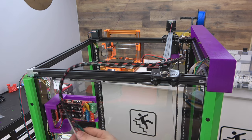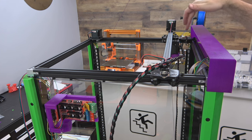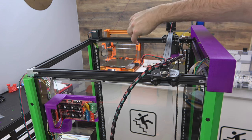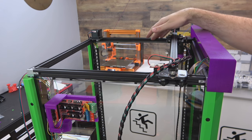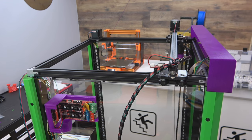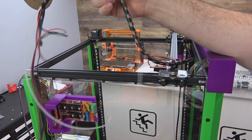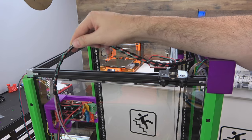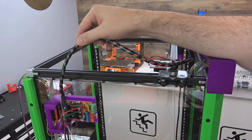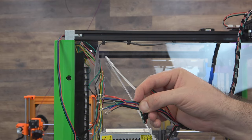I've got all the wire wrapped back to the control box. I did just realize the control box is flipped upside down, so I'll have to change that. I made a few changes as far as how the wires run — the Y end stop being the biggest one. I had it running on top but switched it to the bottom because it had a chance of getting pinched by the carriage when it came to home. You're going to have to play with that a little bit — just figure out what makes sense for wire management to get it looking good. After I switch the control box, we're going to have to clean up all these wires. A lot of these motor cables are way too long, so I want to cut them, put a DuPont connector on them, and get them looking nice so they fit nicely on the machine.